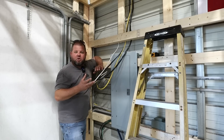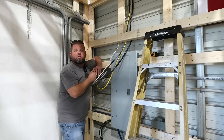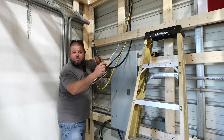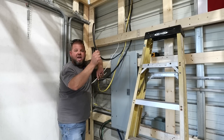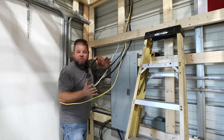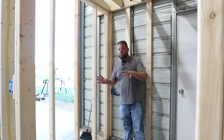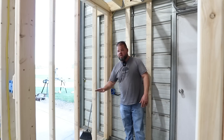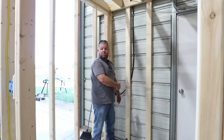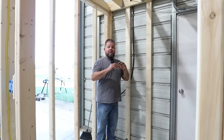This is learning, and in the process you learn some stuff and maybe find some products you're looking for. We've had a lot of people come over to the channel recently because of solar-related stuff and reviews in general. I have a 6-gauge wire right here that can handle up to 50 amps of 240 volts — we're going to need that for future testing. I have 8-gauge wire here, multiple separate 12-gauge receptacles so we can charge multiple power stations at a time, and 14-gauge wiring to run some simple lights and an exhaust fan. This entire area is probably where I'll do the majority of my testing. I'm going to build a 32- or 36-inch tall workbench — that's why my receptacles are so high. We're also going to put a 50-amp generator inlet box over here so we can power back over to the panel and plug in smaller stations to test.